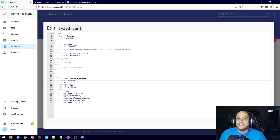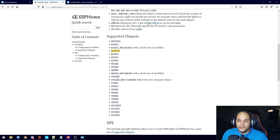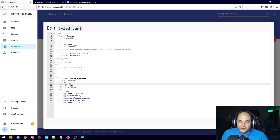The chipset depends on the specific strip you're using — check the website for your specific strip and add it in the chipset field. Then the pin: your digital strip uses just one data pin, and I specified mine as D5. For number of LEDs, the effects will run according to the amount you specify — on mine I have 45 LEDs. You can individually count them or just type in the amount if you bought a strip that specifies the LED count.